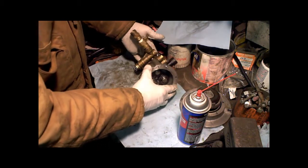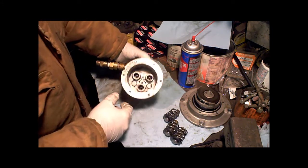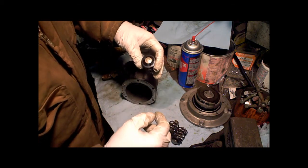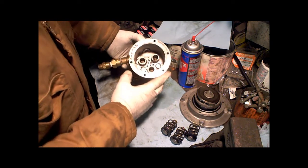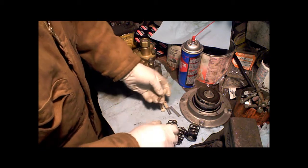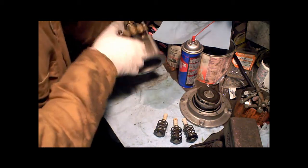Let's get into the body of it. From the back side, you should be able to pull out these three pistons. The first time I repaired this, it was due to just one of these spring keepers at the top — this little piece had actually fractured, so the return spring wouldn't return it. I replaced that about the first time I repaired this, a hundred hours ago or better. There are three other pieces — these would be your valves, kind of. They just slide inside each one; there's one spring for each one, and one of these. That's everything you need access to through there.